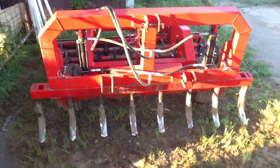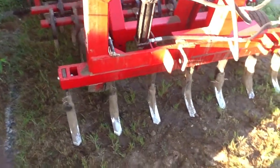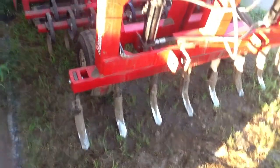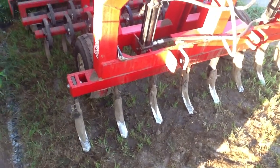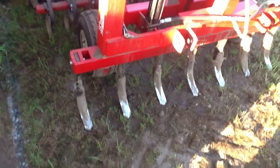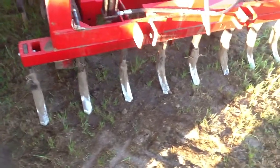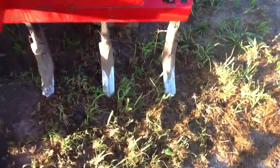We're going to start up here at the front. This is an eight-foot unit with the optional hydraulic rippers — they come in manual rippers as well. The same basic principle: one is operated by hydraulics from your tractor, the other you have to get off the tractor and manually adjust pins. Up here it has the eight chisel point plows, all of which have the reversible heads on them.